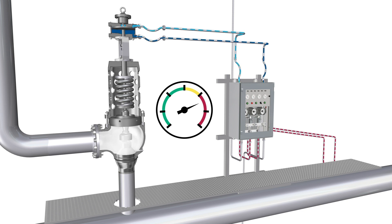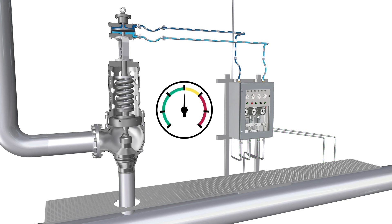If the safety valve is opened, the pressure of the system starts to decrease by releasing fluid with a specified mass flow. Should the pressure within the system then fall below a certain closing pressure, the control unit once again switches on the loading air, helping the valve to close.